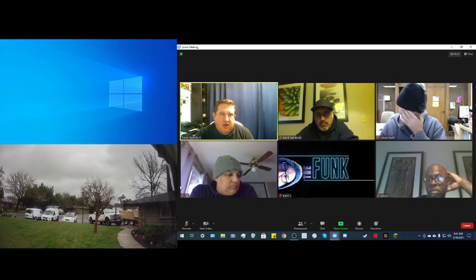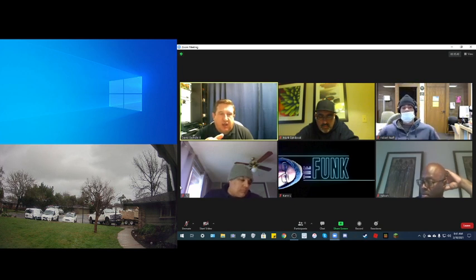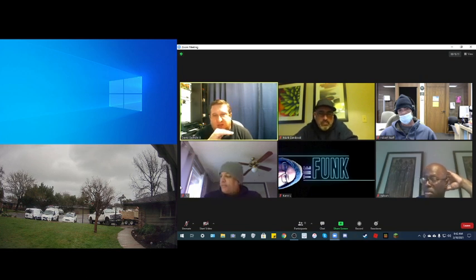But basically the concept with polishing of stone is to use progressively a different grit of diamond. The first step is really to cut the stone with a diamond tooling. Okay. Now, most of the time, it's a synthetic diamond that's embedded into either metal or an epoxy resin that holds it into what we refer to as a puck. And that helps us to cut the floor surface smooth. And that's what gives us that initial cut and will expose aggregate if we're dealing with concrete or terrazzo.